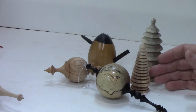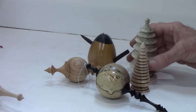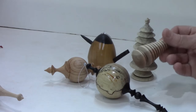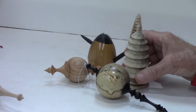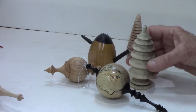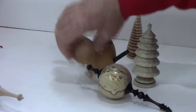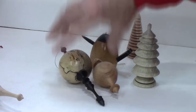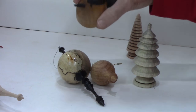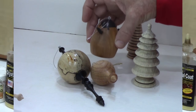One aspect of detail is weight. A general rule of thumb is ornaments should not weigh more than about two ounces or they tend to weigh the tree down. These all fall within a pretty narrow range. The lightest one is seven-tenths of an ounce. The others vary from about 1.1 to about 1.6 ounces. This one is solid. This one is hollowed but it's a little larger, so there's not a great deal of difference. This one has been drilled out but is fairly heavy — about 1.6 ounces, the heaviest of the group.